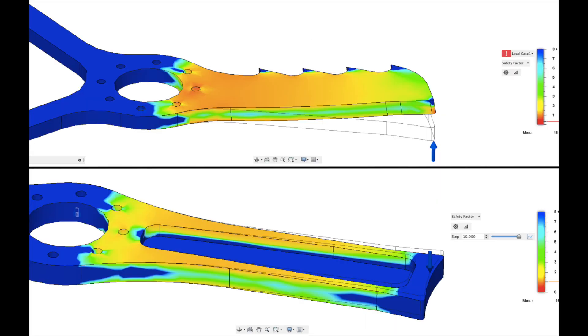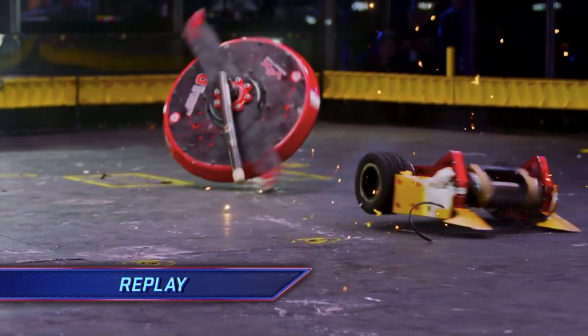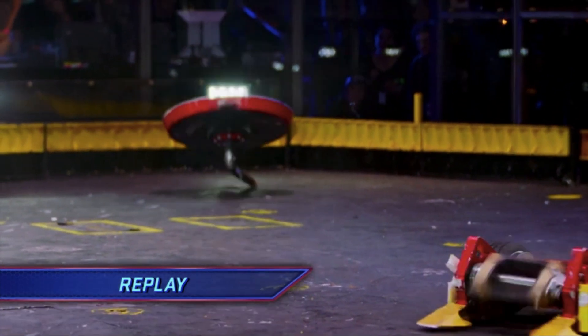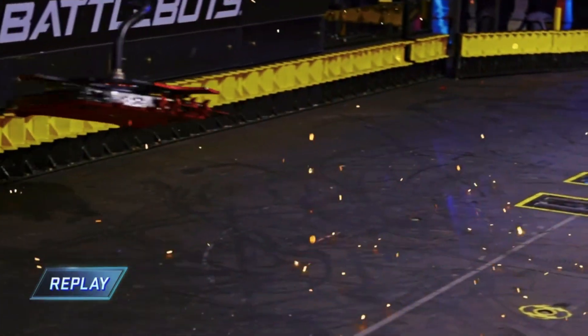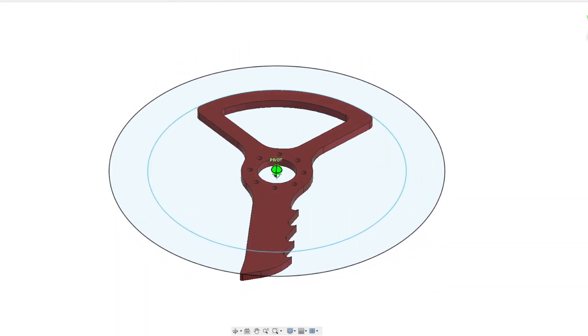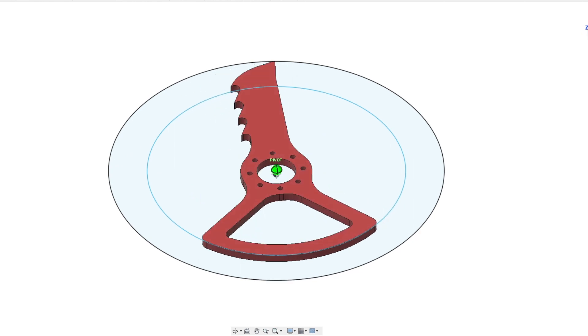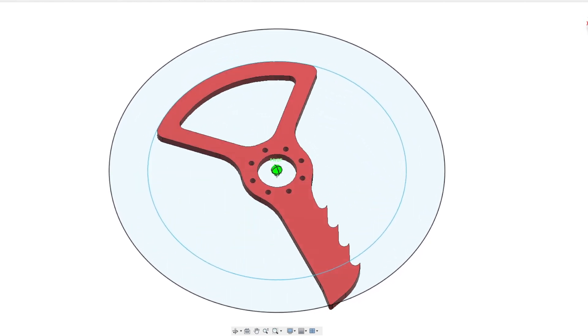In fact, the Key is almost as strong as the thick bar we made for 2020. The last big secret to unlock is stability. We hadn't dived into the physics of this yet, but we had seen that narrow bars tended to tumble after a hit, while wider shapes like discs or rotors tended to stay level. So we made the counterweight as wide as possible to get as much weight away from the bar's axis as we could, giving it that key shape and hopefully making it more stable.